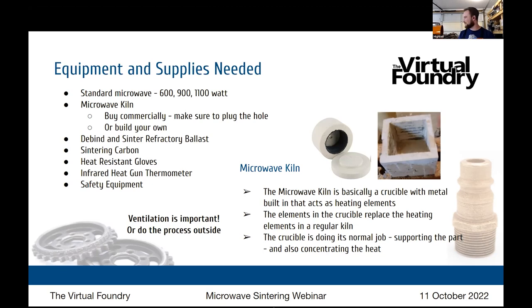Yeah, the whole sinter cycle for some of the pieces that I've done, and again, they're rough, but it's metal. The whole time it takes to sinter from ambient room temperature is about 30 to 40 minutes in a 600 watt microwave. And that's not a lot of time, but you end up getting up to the proper temperatures, again, measured at the scale that I can observe. And it doesn't go past the point of melting because we have maintained shape. So I know that to some degree we're getting even heating with the proper element placement. And it's enough in a rough sense to produce the metal part, but certainly more needs to be done.